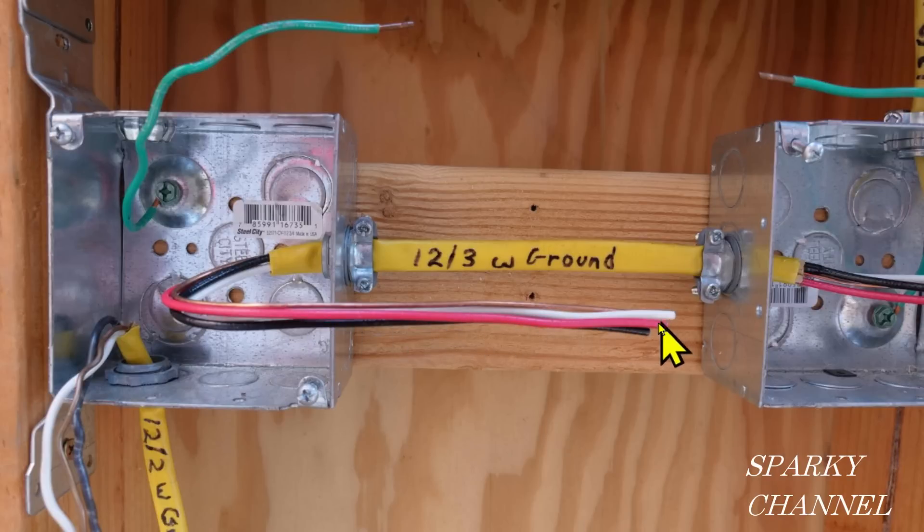This happens to be a little over 8 inches in length, so it's got plenty. The other specification is that this wire has to extend at least 3 inches beyond the edge of the box, provided this box isn't greater than 8 inches in any dimension. The way I read that is you go from corner to corner. This is a 4 by 4 box, so this dimension is going to be 5.66 inches — it's under the 8 inches in any dimension. So it's a small enough box, and it easily extends at least 3 inches beyond the edge.